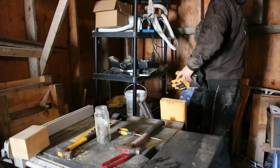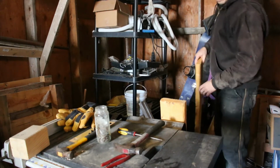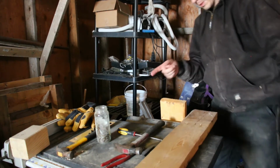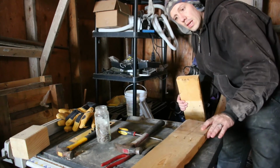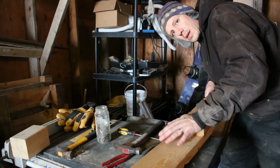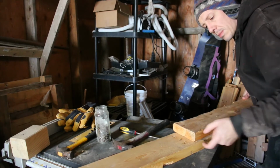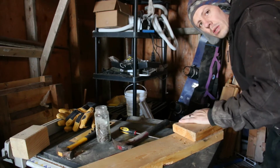The way I'm trying to make this tabletop. I'll set you down here and I'll pull a couple over and we'll show you. So my plan is, I'm gonna use this table saw and we're gonna make lap joints. So I'll take 3 of these, actually, and they'll be overlapped about that far. Make a lap joint, so we'll cut them half the thickness, put them together, we'll glue them, put some pegs in to hold them tight.